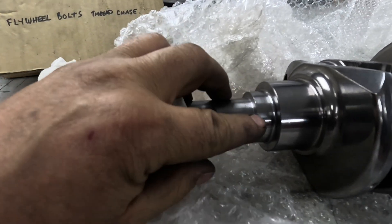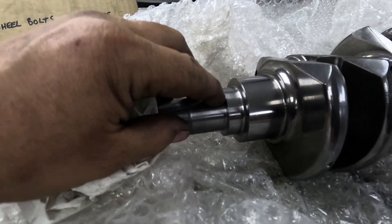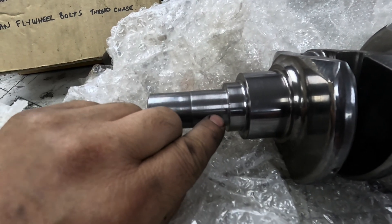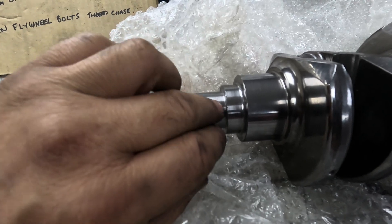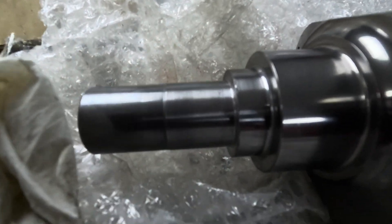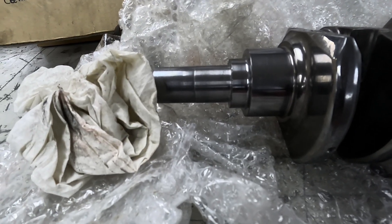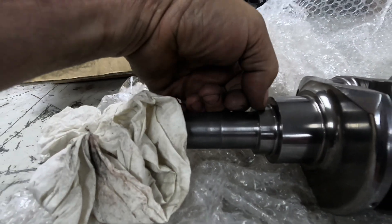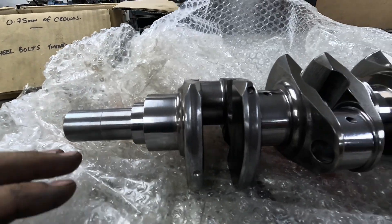The end of the crank is all polished up and I've polished some of these little chippings away where it's so hard. I've put a nice little radius in there. There are a couple of little lines in there from the cutter on the lathe - where it's so hard, as soon as it bites into the hardness it almost drags in a little bit, but you can't really feel it. You can just see it slightly if I zoom in - I'm a little bit annoyed about it, but I've measured all the way along and the size is right. That little line is all covered up with the gear anyway so it won't affect it, and the oil seal runs further along so that won't be a problem either. All done.